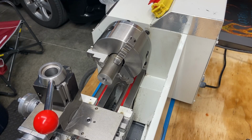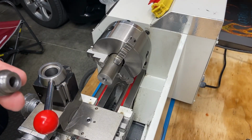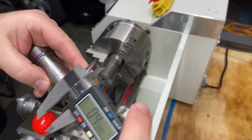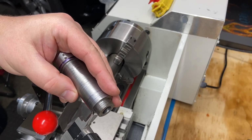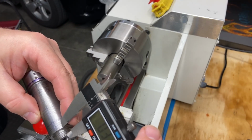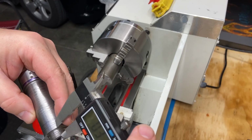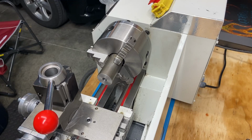All right. So 800 thou, and the depth, all I really need is that depth, which we covered in other videos, and that's about 300 thou, 285 thou. Yeah, 300 thou or so. But I'm going to leave as much on there for threading as I can, because I can always turn that down and whittle that away.